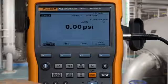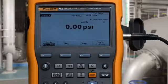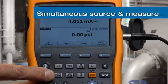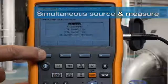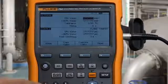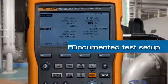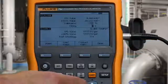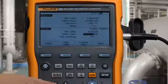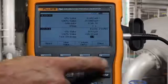Vent to atmosphere and press clear zero in case there's any electronic offset to clear. Next, we go to the split screen to do calibration. Select 'as found' for an instrument. We're going to measure four to 20 milliamps to a test tolerance of 0.5%, and we're going to source zero to 100 psi. And we're going to do a three-point test.